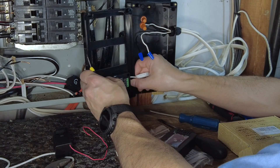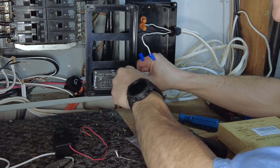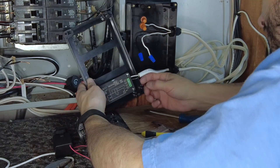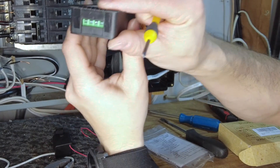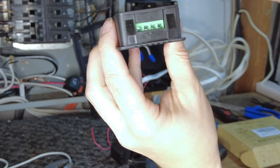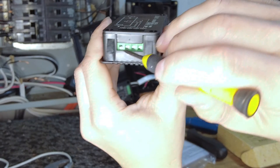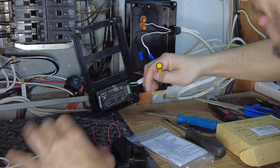I have a degree in electronics and engineering — I'm not a qualified electrician — but this is simple and basic enough that anyone with a little hands-on experience can figure it out. The little metal tabs inside the terminal move up and down. If the screw is loose they fall back in place, so you have to make sure the wire fits in the hole and then cinch the metal plate down with the screw. Let me show you — I'll unscrew this and demonstrate how the tabs open and close.